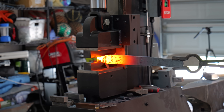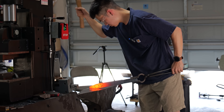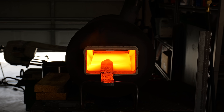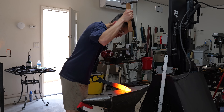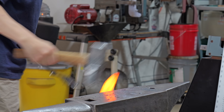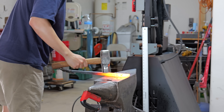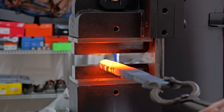The thing about the Viking sax is that its blade shape is very similar to the modern bowie — keep in mind I said similar. The sax has a much lower blade and much less aggressive curves. When you see the finished knife, I want the first thought to come to your mind to be 'oh wow, that's a sax,' not 'that's just a weirdly shaped bowie.' I also forged the tip early because it's less tall stock and I don't really like forging tips on wider stock.